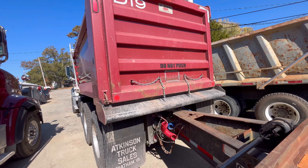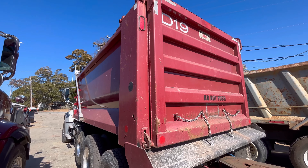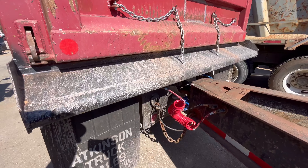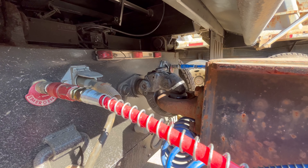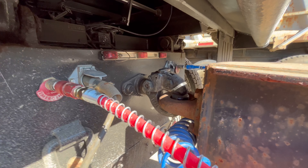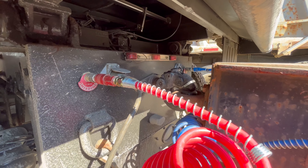They're 24.5-inch wheels with 11R open-shoulder tires. When I say open-shoulder, it's got a cutout so if you get stuck in mud it slings the mud out, which is great for what I do. But if you do asphalt paving, you'd probably prefer a closed-shoulder tire — otherwise you're going to be ripping chunks out of your tire. I hope this is the kind of video the subscribers want — I know these can be a bit boring but anyway.